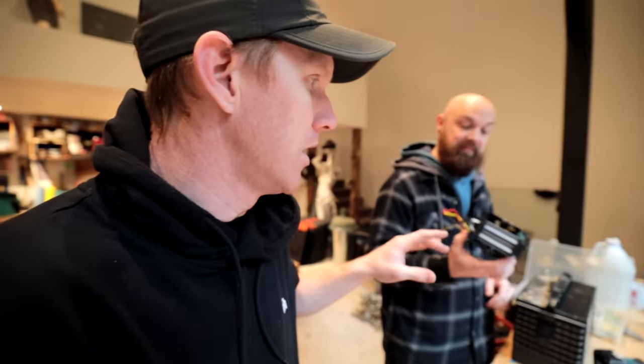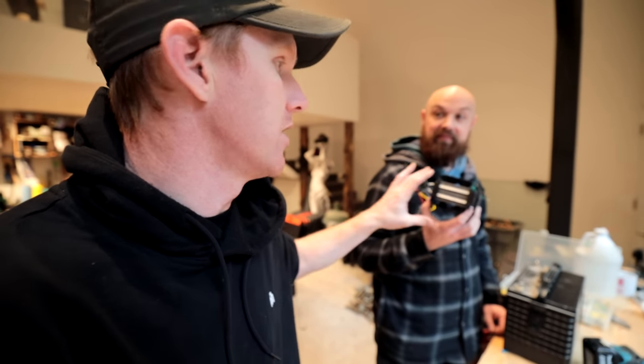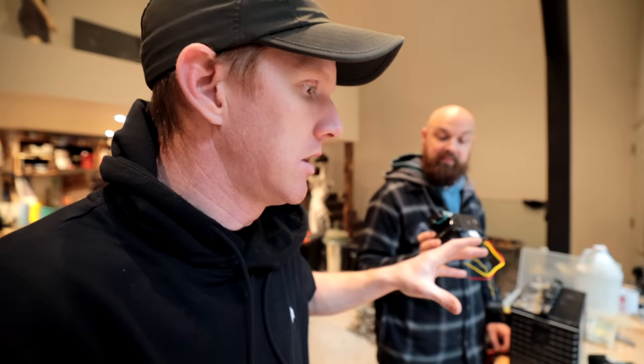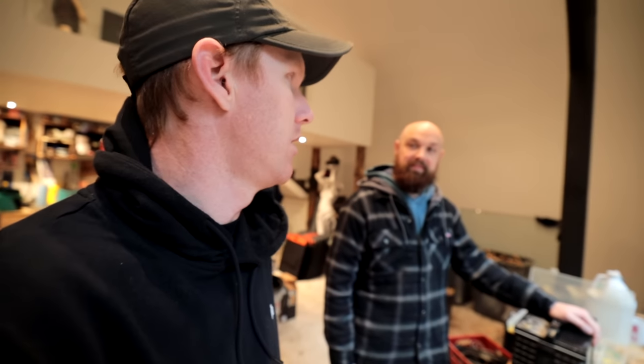We've got old computer parts that we're wiring. It's a CPU fan essentially, to the 12 volt heater. And then that goes to the battery, which is in turn going to be connected to a timer, which is going to run a heater for the batteries to keep the batteries charged, because cold temperatures and batteries do not get along. Especially lead acid. You want to keep that above zero.